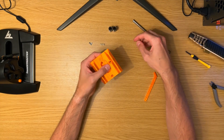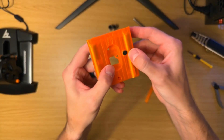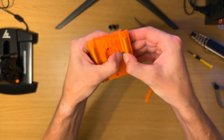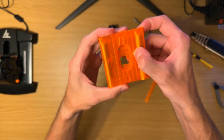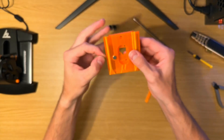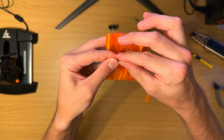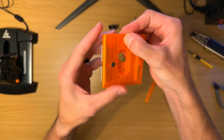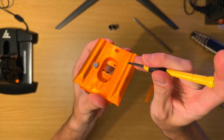This next portion is going to be very easy. Take one of our eight by three millimeter magnets and just press it into this hole — it goes straight in there, nice and easy; hard enough that it will never come out from another magnet pulling on it, but easy enough to do by hand. It's in there, nice and flush. Next is the M3 nut — I usually put the rounded side first so it doesn't catch any edges going in. Press it in with the screwdriver — it's in there all the way.